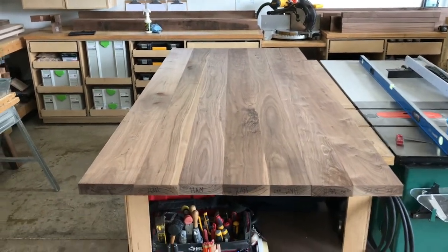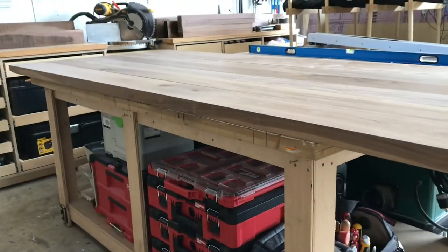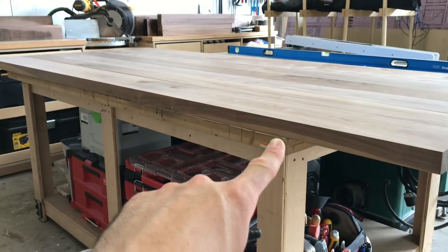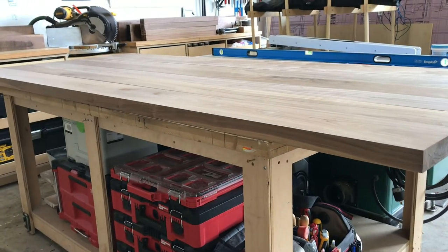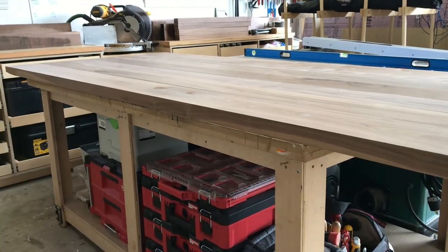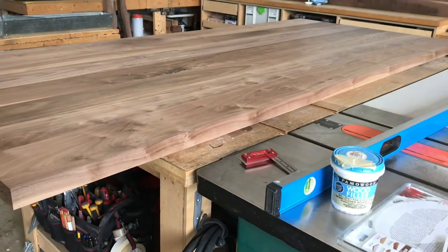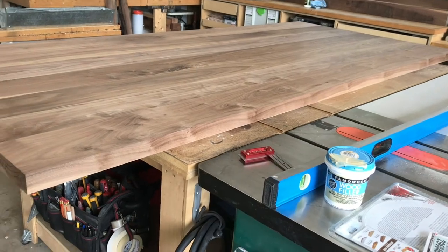So the last thing I have to consider, this tabletop is about 3 inches wider than the final width. So I want my edges to have as much hardwood as possible for this table. These sets of blonde areas, the sapwood areas, when I trim off about an inch and a half, are going to eliminate most of this blonde streaking. And really the same thing on this side. Most of that blonde streaking, this one doesn't have as much down there, will be reduced.